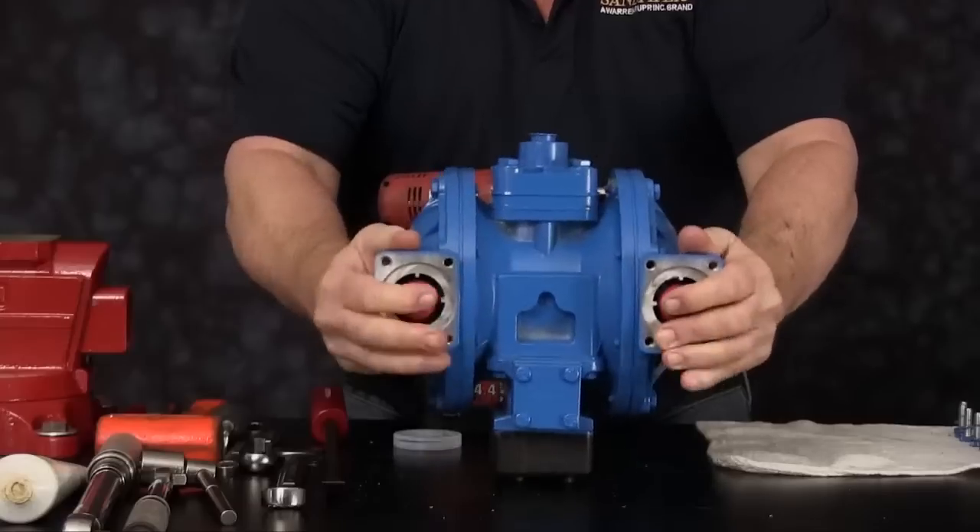Roll the unit over. Using a pry bar, get underneath the inner plate of the diaphragm assembly and push down to invert the diaphragm to the discharge stroke. You can now invert the diaphragm over and line up the holes to install the second outer diaphragm chamber. As on the opposite side, inspect the seat area where the check ball seats are going to go. Inspect the suction side ball cages to ensure they are in good condition. The discharge side of the chamber should be up towards the serial number plate. Install the eight cap screws securing the outer chamber into place.